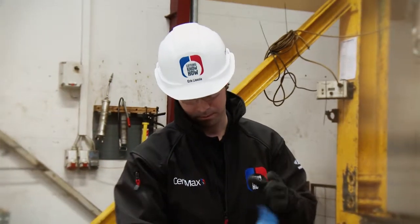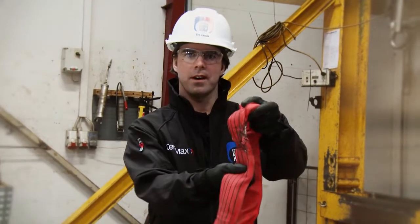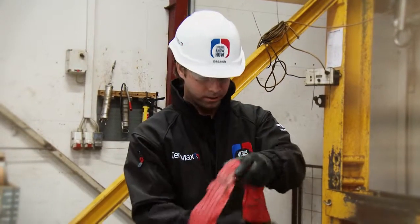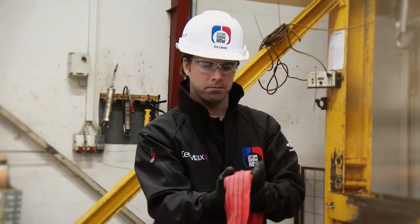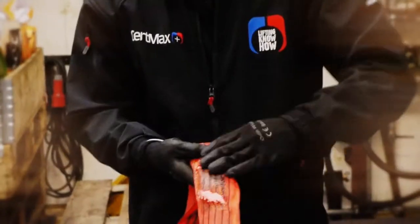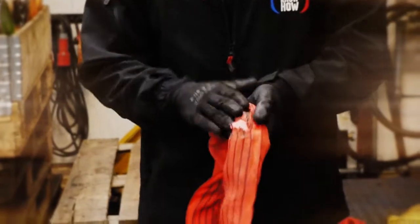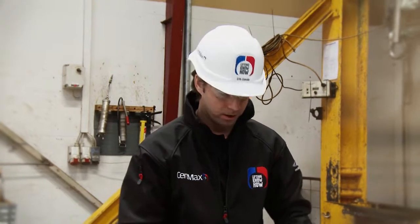Last one. Here you have it — you can see heat-generated damage here as well, probably from sliding when lifting or something like that. When there's heat on the outside, it means there's heat inside as well, and the fibers have melted together. That means I put it out of service directly.